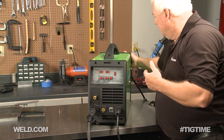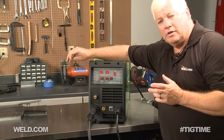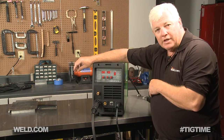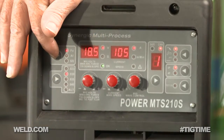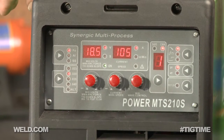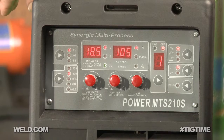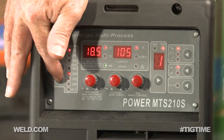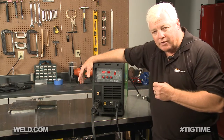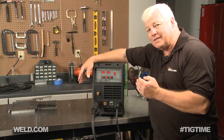It's kind of interesting with this machine — it's got so many little features but it's actually pretty easy to set up. I didn't look at the instruction book; I just looked at the machine and thought anything to do with MIG welding is what I want to set. Right here it has a category for iron, aluminum, or stainless steel, so I set it on iron or FE. Because I have .030 thousandths wire, I set it on .030. MIG welders are constant voltage, not constant current, so whatever you set the voltage at, you need to adjust the wire speed to match.